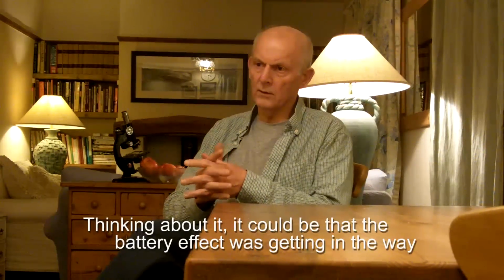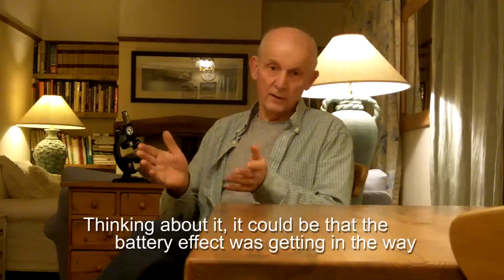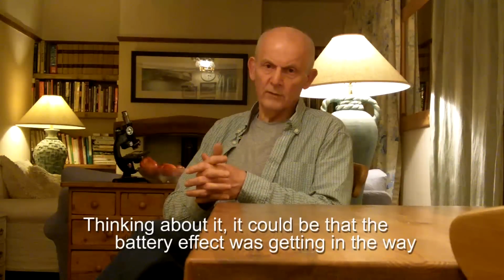But earlier in the day I found if I tried to measure the resonant frequency with the cell immersed in water, I couldn't get a proper response at all. So it's almost as if something has changed through the day. I don't quite understand it, but as I say, at the end of it you could see that clearly we'd found resonance for that cell. I think for anybody trying to find the resonance of a very low capacitance cell at low frequency, it's going to be extremely difficult.